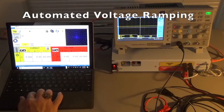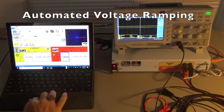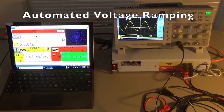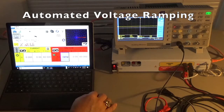Let's use the SMRT to do some voltage ramping. Go to the ramp icon, select it, and under standard you'll see ramping — choose voltage. Select the ramp parameters: channel 1, amplitude, click check mark. Choose the linear ramp. Start voltage at 60 volts, stop at 120 volts, and increment at 2 volts per second. Hit play and watch the sequence on the oscilloscope. We started at 60 and ramped up to 120 — the scope shows the RMS value rising: 101, 102, 103 … 110, 120. It ramped up and stopped.